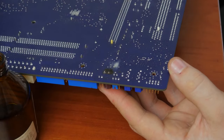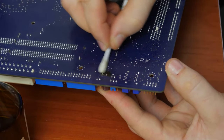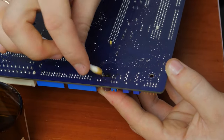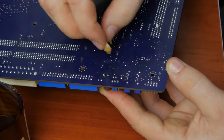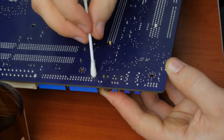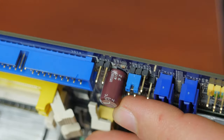Once the soldering operations are complete, don't forget to clean the area of the motherboard with a special fluid — something like a flux-off spray, isopropyl alcohol, ethyl alcohol or refined gasoline. Doing so is highly recommended, as there might be tiny droplets of solder all over the motherboard area that can cause circuits to cross and short out the motherboard. Even the flux can come into reaction with other components, so it is better to be on the safe side and do some cleaning.